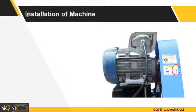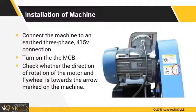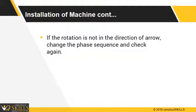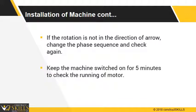Installation of machine: To start the machine, connect it to an earthed 3-phase, 415 volts connection. Turn on the MCB and check that the direction of rotation of the motor and flywheel is towards the arrow marked on the machine. If the rotation is not in the direction of the arrow, change the phase sequence and check again. Keep the machine switched on for 5 minutes to check the running of the motor.